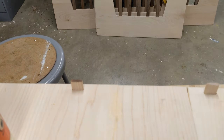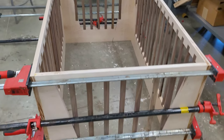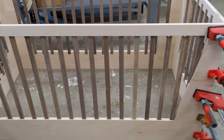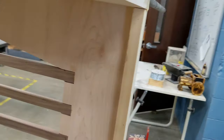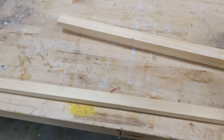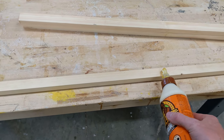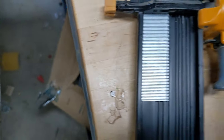There's a lot of discussion about whether dominoes add strength or are just for alignment. In this case they absolutely add strength - especially on the opposing side where it goes into end grain. End grain doesn't glue up or hold very strong, and a floating tenon with full glue coverage gives more strength and perfect alignment. I rarely show the glue-up process because I stress out about it - I'm running around sweating trying to find clamps. I added little nailing fins, glued and brad nailed them in as permanent parts to hold up the slats supporting the mattress weight.